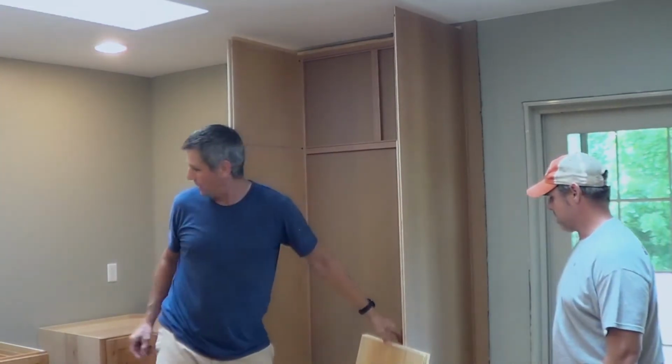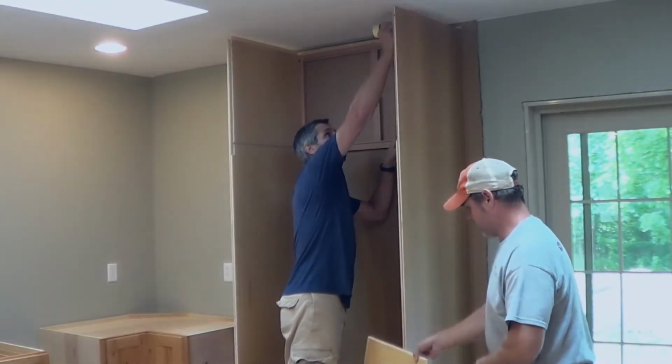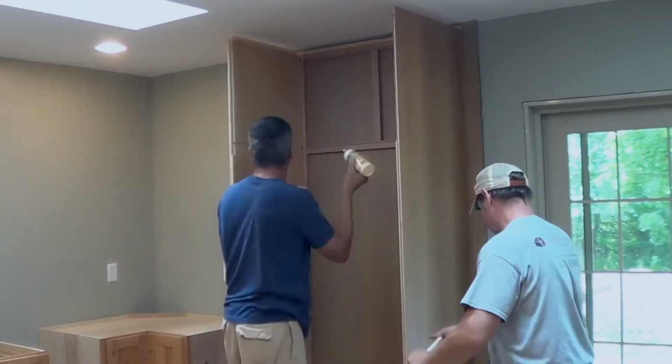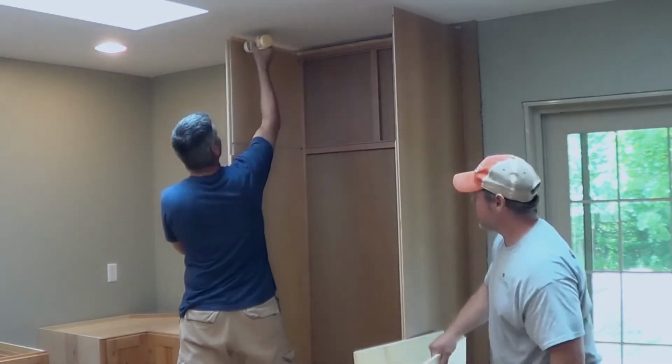We're going to grab our glue bottle, and we're just going to do what you normally would. We're going to glue halfway down our slots for our dovetails. But again, the halfway is so that the dovetail will spread the glue the rest of the way and you won't have a gluey mess running out everywhere.